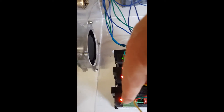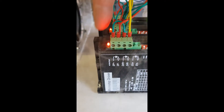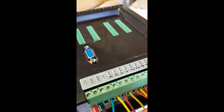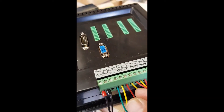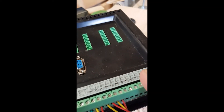I'm powering with 12 volts at 2.5 amps, which is more than enough. I have 5 volts bridged over for the signal lines — the green wire is 5V, the yellow is direction, and all direction wires are connected in the same spot. The red wires are pulse and they're all connected together.